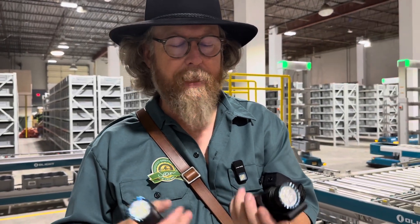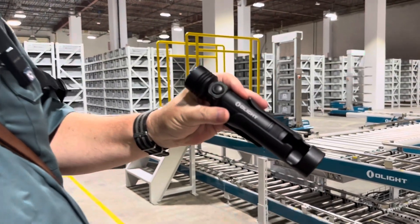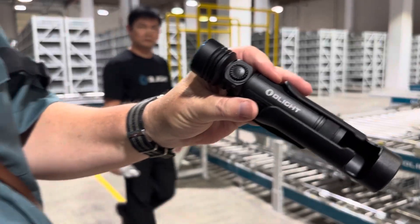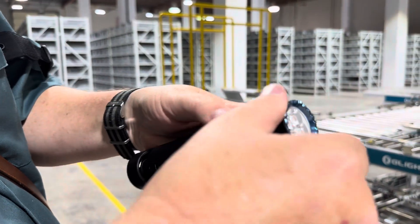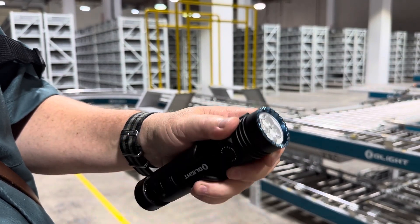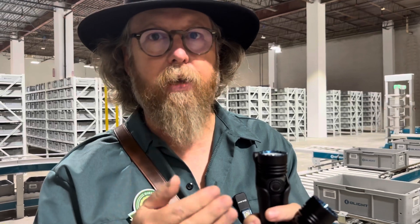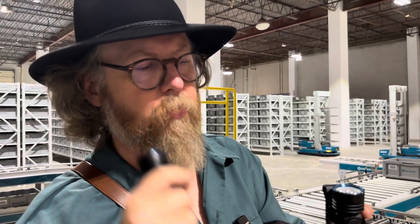The Seeker 4 is now 4600 lumens compared to the 4200 lumens of the Seeker 3 — same emitters, same everything. How do they get the extra lumens? A higher efficiency driver. That's what you want to hear — they're always improving efficiency. These are probably Osram P9 emitters, I'm not sure, but I think they are. You can get in there with strap wrenches, bust the bezel apart, take the board out and put whatever you want in — they're 3535 emitters. Regarding specs: this old one is 6000K tint, this one is 5000K. I measured it on the Sekonic and it's 5000K — just over BBL by about 50 points, really nice. The tint is way better on this one.